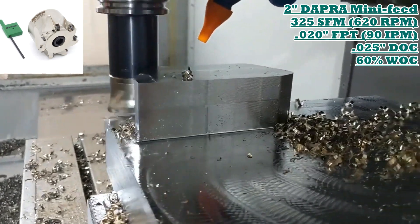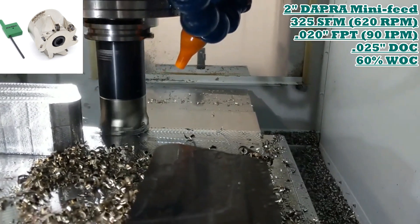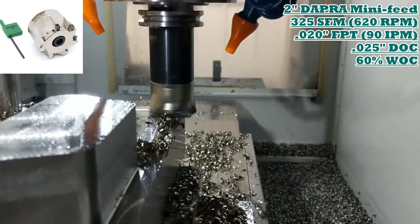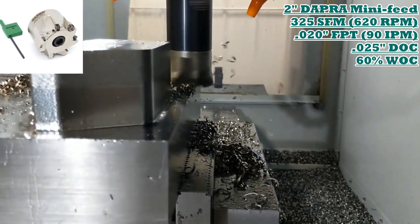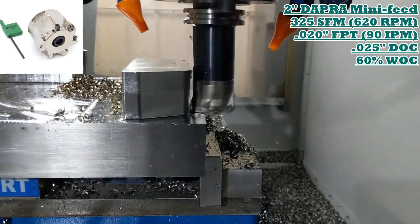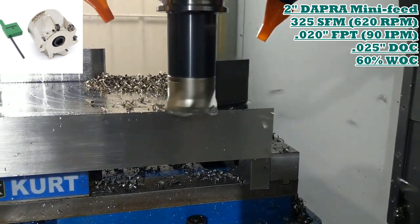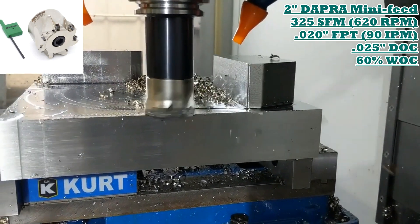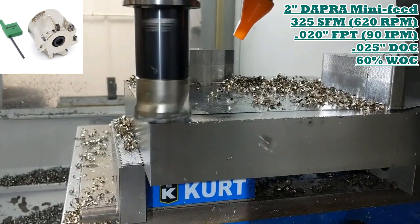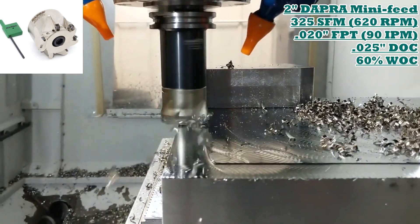Here's another good example — the cutter is actually hanging half on and half off the workpiece, which we generally don't recommend, but obviously not all jobs are as clean and perfect as we would like, so sometimes you have to hang a tool off. The high-feed inserts running here are tough and as such a little more able to handle the shock from an interrupted, intermittent cut like that.